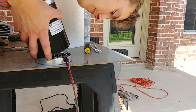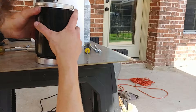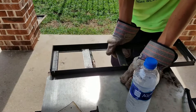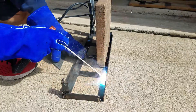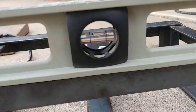It turns out the bolts were too long and had to be cut down a bit, and everything fit nicely. The entire disassembly was probably unnecessary, but I was curious and thankfully the motor spun up just fine when I tested it. To accommodate for the thickness of the motor mount, the angled sides of the chassis needed to be moved outward by about an eighth of an inch. I broke off the tack welds on the chassis and re-welded — I did this to both the top and bottom halves — and with some adjustments, everything fit together.